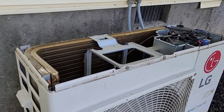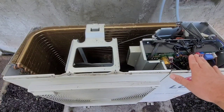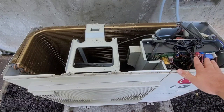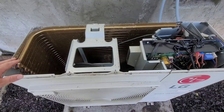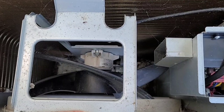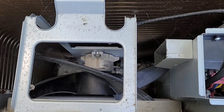It's nasty in there — you're going to see some spider webs and maybe some debris. There are similarities but also differences between units. My electrical components are right here on the right, along with the motherboard and all the wiring. I'm going to do my best to keep that part dry during the entire process. My coil is only on the left and the back; some coils go around the left, back, and right side, so yours might be different. I'll spray down the entire coils on the back and side. First, inspect the inside — any big debris or leaves, take the time to get that out. I have some cobwebs but I'm not too worried; those rinse out.